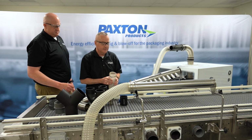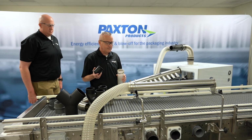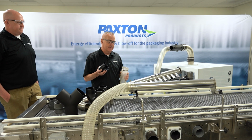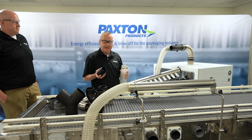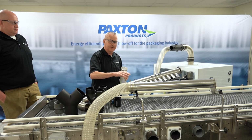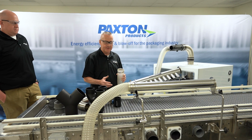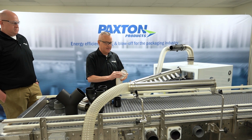Now this would be the time where you would add the flow control valve, if desired. It's not a requirement. It just does give some adjustability at each individual air delivery device. For this video, I'm not going to install that.